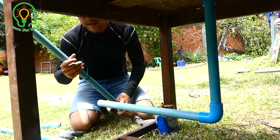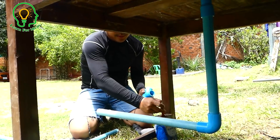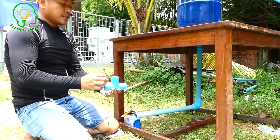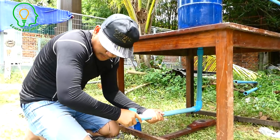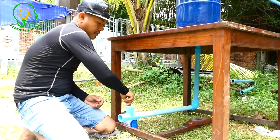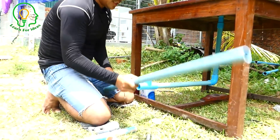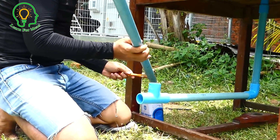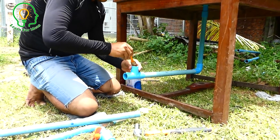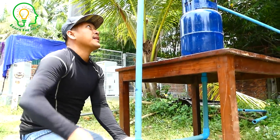Actually, we need to have the air pipe when we install the water. I use the air pipe here. When we first install water, we need the air pipe to be open — using this valve here — to allow air replacement when water is refilled into the tank. I'll use this one first, putting sealant inside here to make sure it's waterproof. It seems like it's already firm.